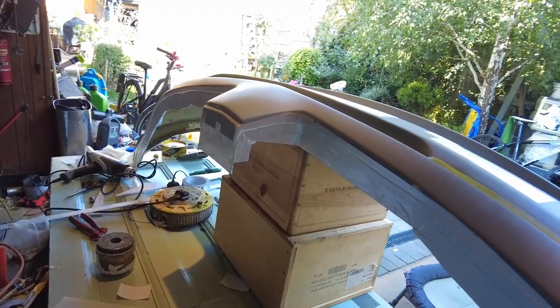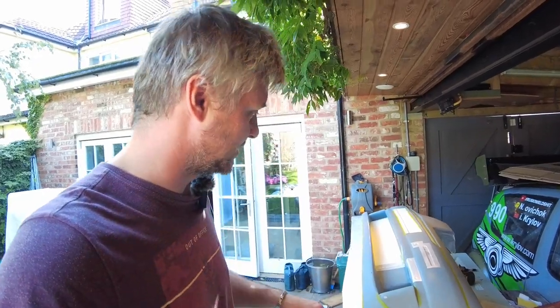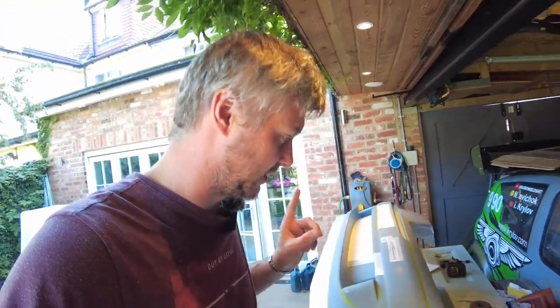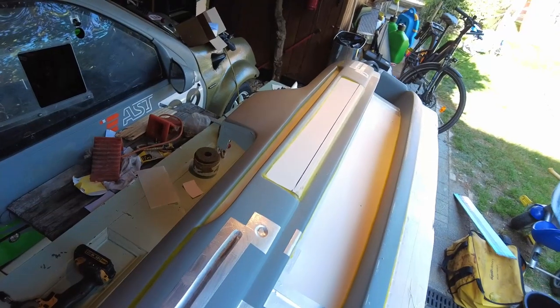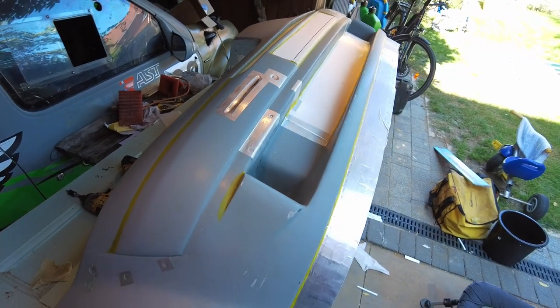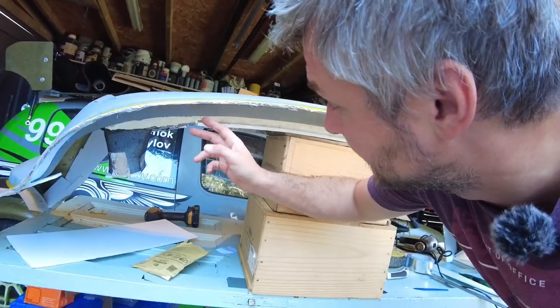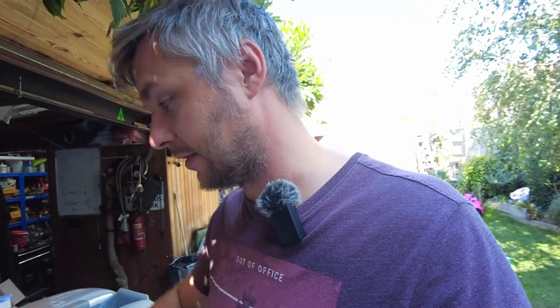Everything is flanged all around, and all the holes are filled with metal tape. I waxed it already with one layer. Need to wait 15-20 minutes, then wax another one, then buff it. Then we apply PVA release agent, and again, this is not PVA glue, it's PVA release agent. I've simplified it ever so slightly. On the original bumper, as you can see here, the lip is a lot bigger. There is no need for this lip. I actually want it to be a little bit flexible, so we're making this lip a lot smaller.